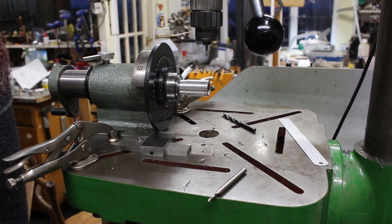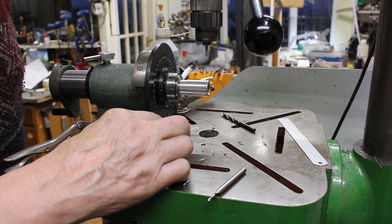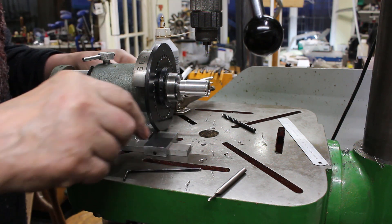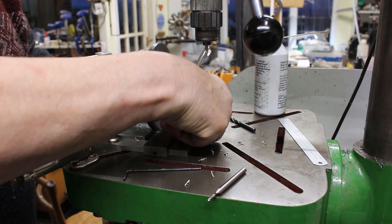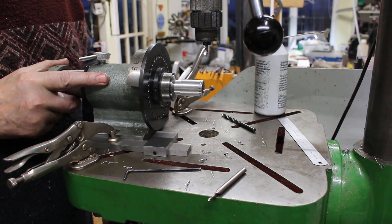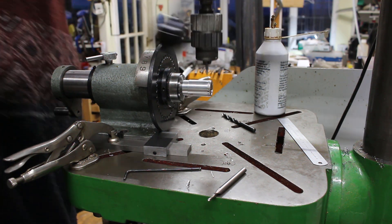Okay it's looking good. So now we need to move it 4mm because it's a drill at a 4mm pitch. So I've got a 4mm diameter end mill — I'll put that in, bring it up, tighten it. Release the indexer, bring the end mill out. So you've got to be careful here — you don't move the parallel or anything, so you've just got to be gentle and make sure there's no swarf in there. Clamp the indexer down again — so we're ready for the next line.